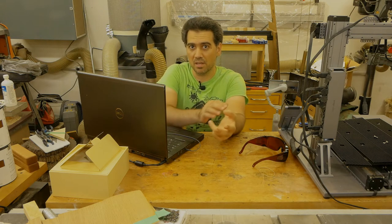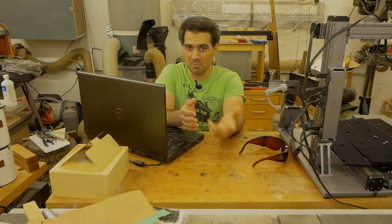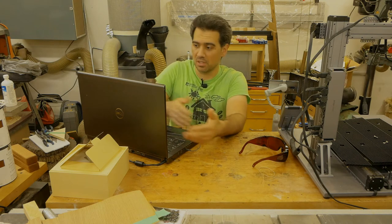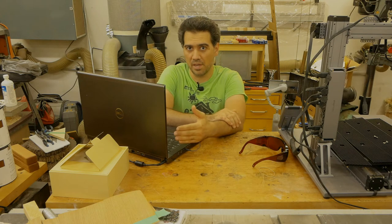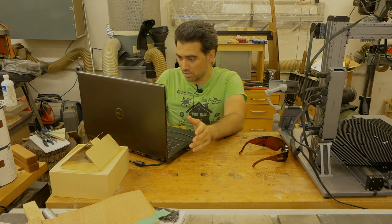I had to do one of two things. Number one, unpackage the package, remove the so-called entry for that dependency, repackage it again, and then install it, which is what I did, and it worked, and I'm just gonna show you here in a little bit. Or create a fake package and install it onto the system so that when the installer runs and sees all the packages are in place, it doesn't throw me an error. So let me show you what I did.